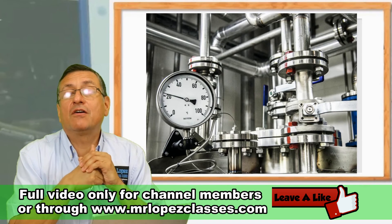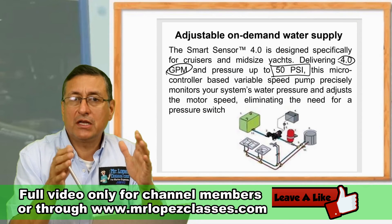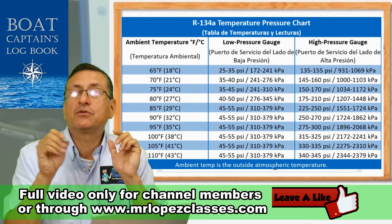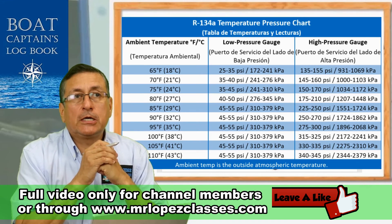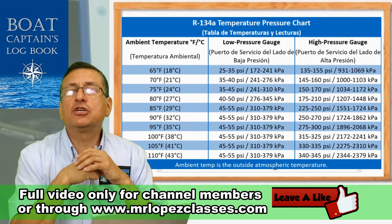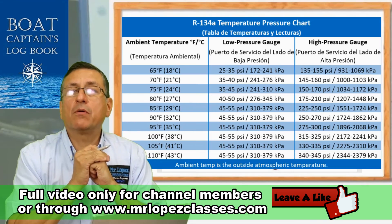You are the engineer of the boat and you need to be organized. I recommend creating a table with all those pressures and checking them at the end of each day compared to the previous day. This is good practice — if one day you find that the pressure has decreased on a couple of gauges, you can determine where the problem is.